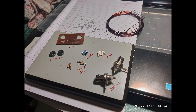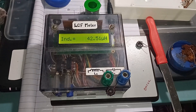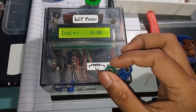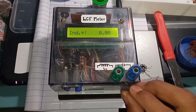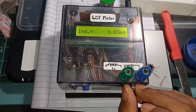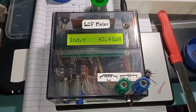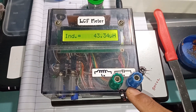These are some of the components used for construction of this meter. This is the toroid transformer used for the HF bridge. I am measuring the inductance of the transformer coils — it's around 43 microhenry. The main purpose is to make sure that both coils are of equal inductance, so that we can get better readings while measuring forward and reverse voltages.